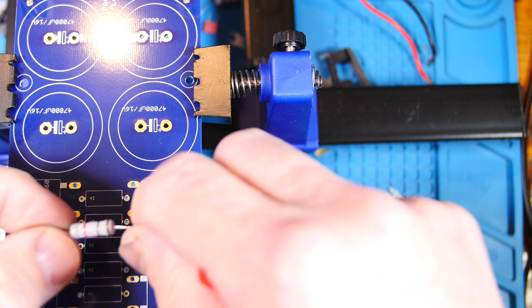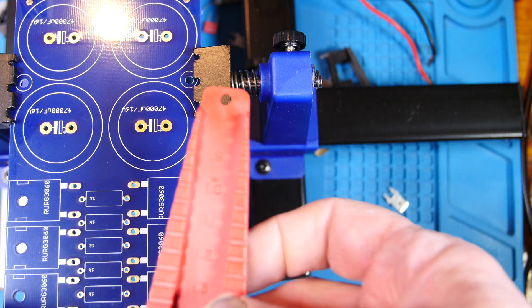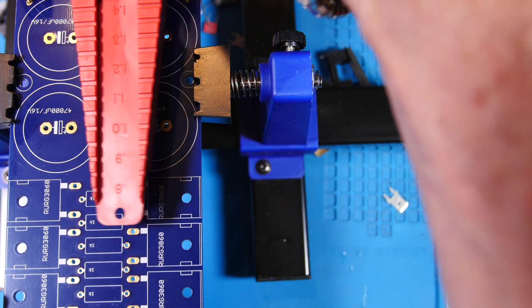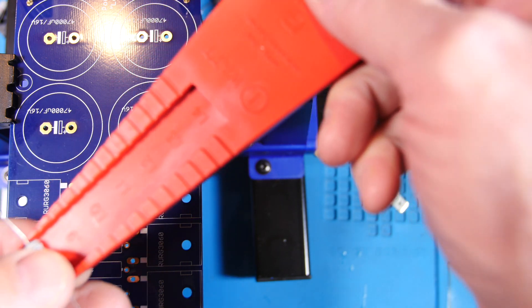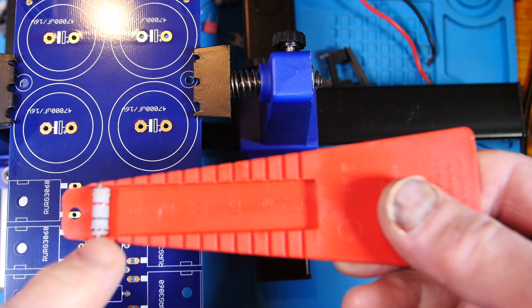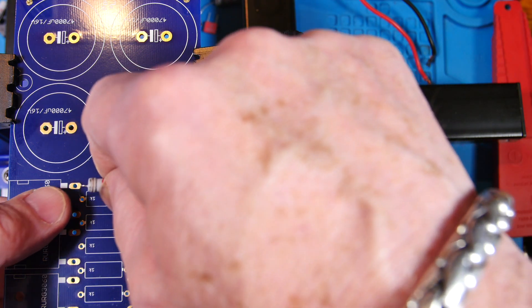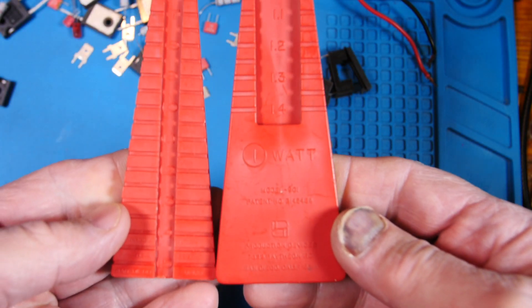A couple of considerations when you put these resistors down and bend them into place: don't put pressure on the body of the part. Use a lead-forming tool — because of the spacing it looks like they're bending pretty close to the body, but you want a little bit of space. Hold the resistor in the tool, push the leads over, and that way you don't damage the lead exit point. Then it drops right in.